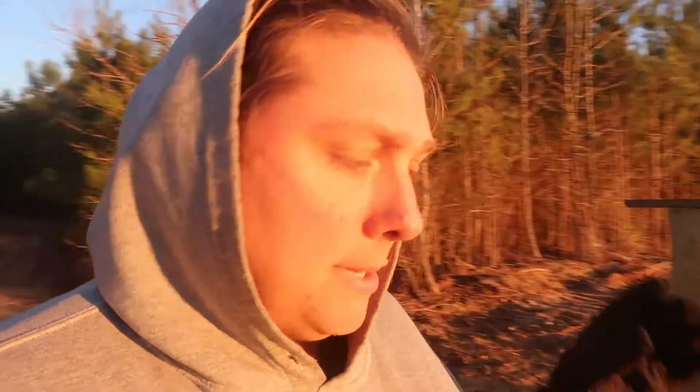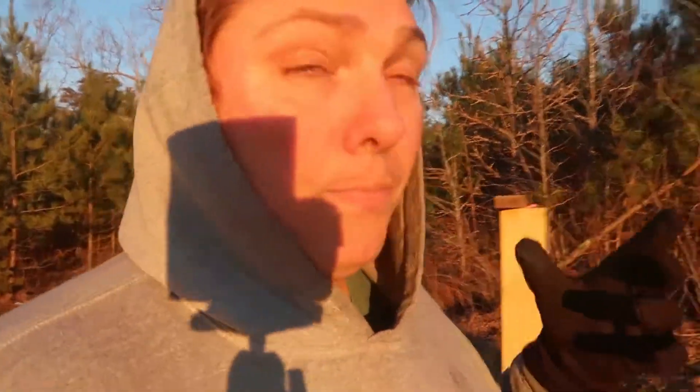What we're going to be doing this evening is actually going and setting where our gates are going to be, because we're putting the fence posts in the ground starting tomorrow. You might wonder why we need to get those gates laid out — because of spacing. You need to know where your extra braces and things need to be put in on your fence line, and you want to have an idea of where your gates and fence line are going to be.